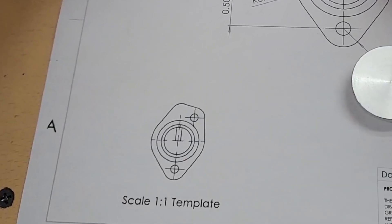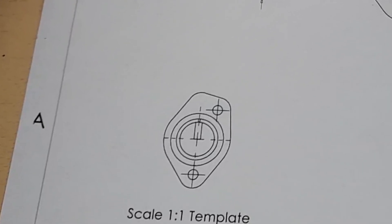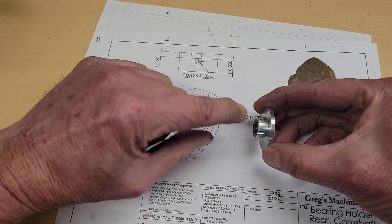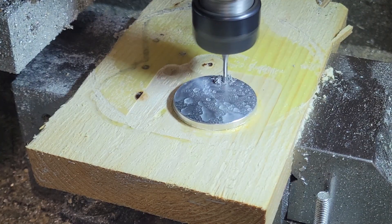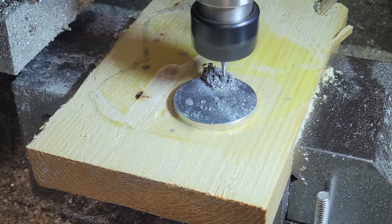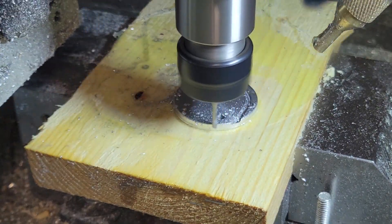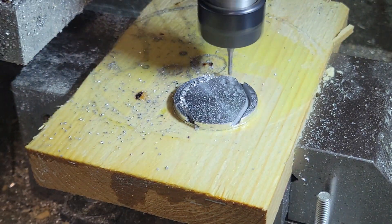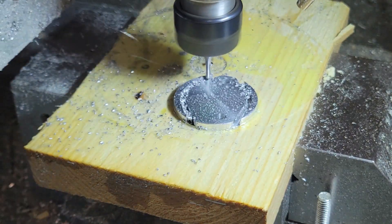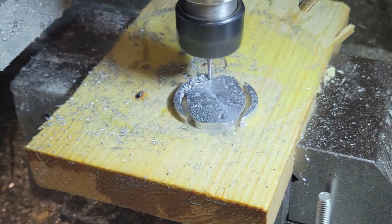For machining this manually I would clamp it in the mill, touch off on the round flange, drill the holes first, and then just use the one-to-one scale template to mark the outside and rough it out and finish with a file. And finally there's an oil hole that is drilled from the top and delivers oil to the center of the camshaft. Greg is going to cheat and machine the outline of the flange and drill the two holes on the CNC router. I clamped a piece of wood in the vise and used a router bit to level the top, drilled a three-quarter inch hole to match the spigot, and epoxied the workpiece down. I used Fusion 360 to create the tool paths for my CNC router. These files are available to my patrons and can be found on my Patreon page, link below.